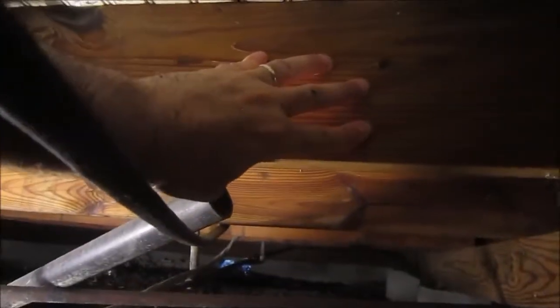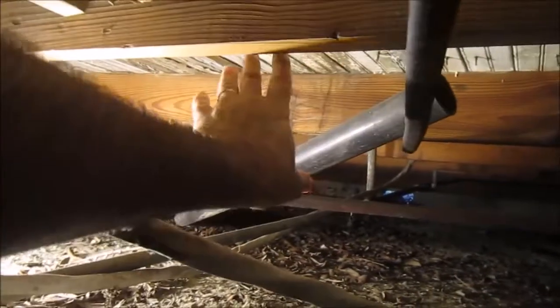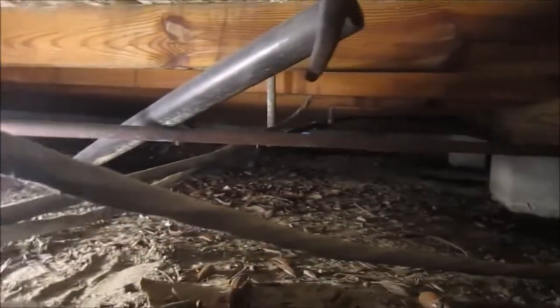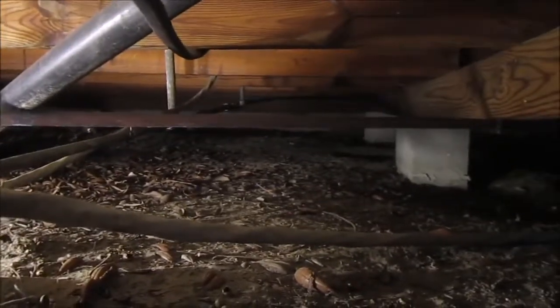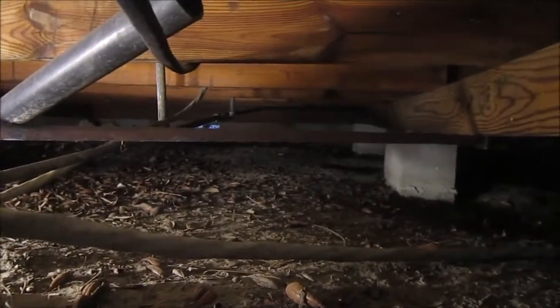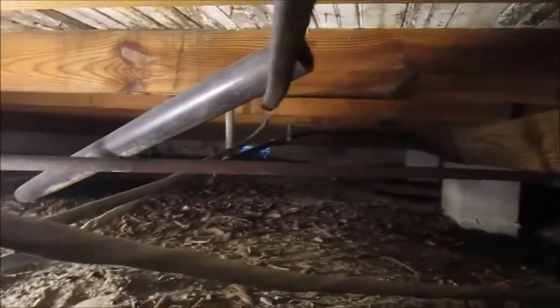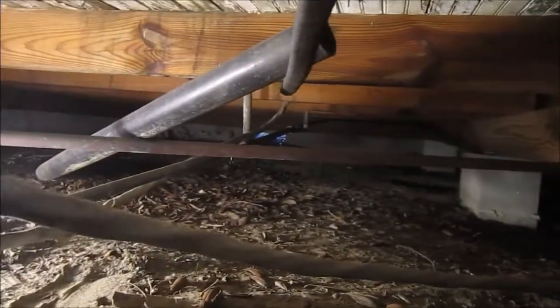Additionally, this is the last joist in the bathroom, and then there is the cut where all the roaches were coming in, and then there are three more floor joists and they sag, which is why that area right under the stove is lower than the rest of the house. So I need to brace those up as well so that they stop sagging,